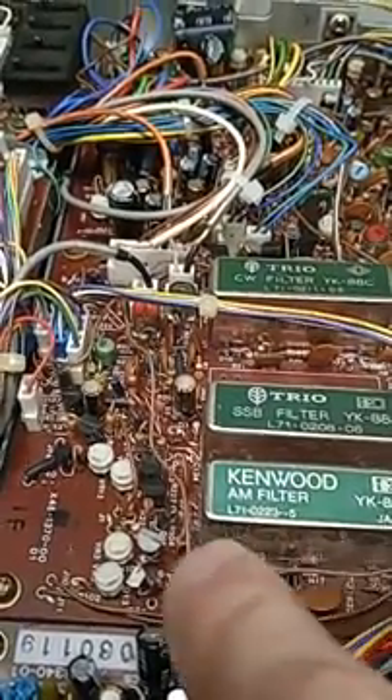Here's the PA power amp unit and the relay output filtering board. This was a real difficult thing to get out and rework — it's in there like a tank. Once out, I think there were five transistor devices on the heat sink and three of the screws were loose. The transistors were removed, the old grease cleaned from the transistors, the mica washers, and the heat sink — which wasn't flat, so I hand-worked it down until it was flat. Re-greased and reinstalled the transistor screws with Loctite. It took about as much time to recondition this unit as it did to do most of the rest of the radio, but not doing it would probably destroy the finals.